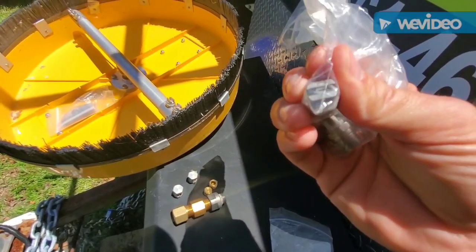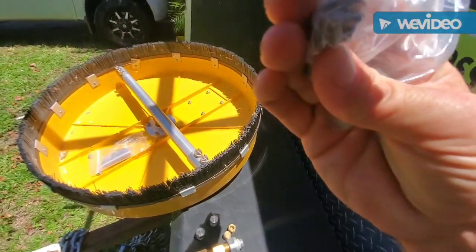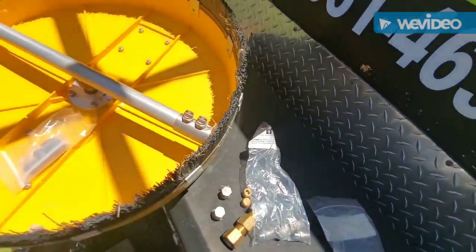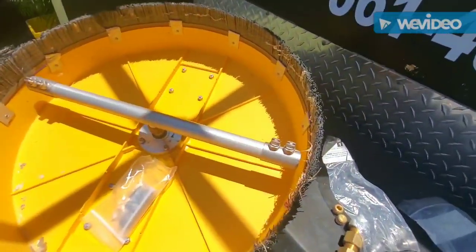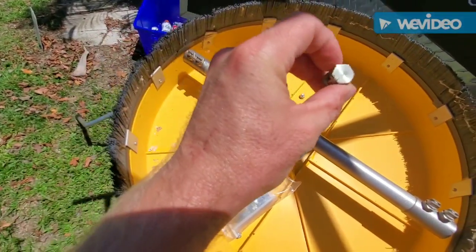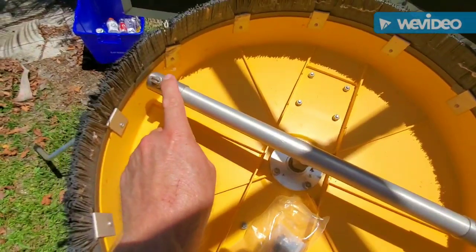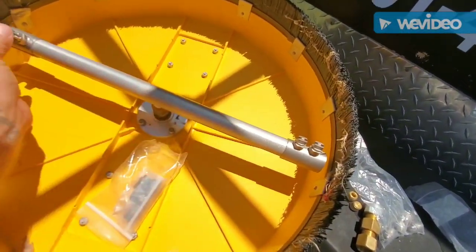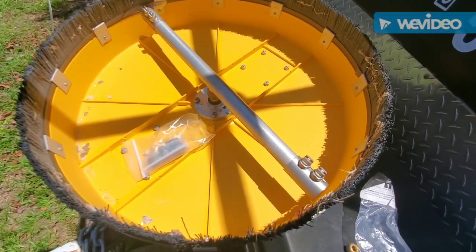When I ordered the 19-inch Whisper Wash it came with four — take my word for it — those are 2502 tips. So when I got the four-tip bar it came with four 2502 tips. Since I had four gallons per minute, four 2502s equals eight gallons per minute total, which was going to be too much flow. So what I did was I ordered these caps or plugs, took the inside tips out, and put these plugs in. Now I had one 2502 on this end and one 2502 on this end with plugs in the two middle slots, which gives you the proper flow for a four gallon per minute machine.